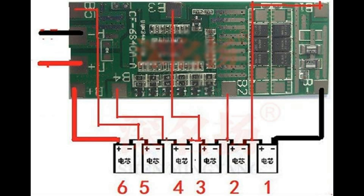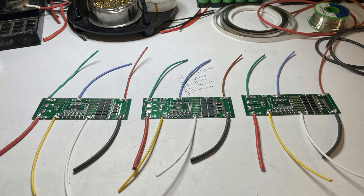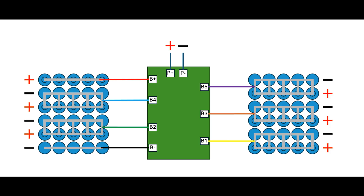The brick is made up of six cells in series, and then five in parallel — so 6S 5P. The nice thing about these little balance boards is they do protect you from overcharging, and they have a cutoff so that if you under-drain it, you can't hurt the batteries.